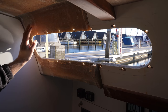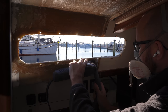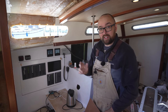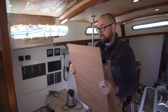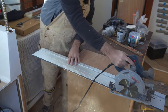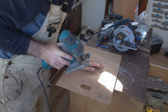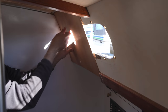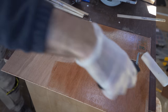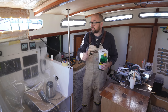There's a little bit of sanding or grinding required here to get rid of some unevenness, and I also need to cut away this piece of the old bulkhead. Turns out, the plywood that's used up here is four millimeters thick. I don't have a ton of that left, but I do have this small piece of scrap, which is perfect. I'll leave this a little bit oversized for now. I've added a couple of holes for some clamps for securing this thing, and I think we are good to go. So let's get some epoxy mixed up. For the sake of paranoia, I'm going to coat the back of this with a few coats of unthickened epoxy. While I'm waiting for that first coat to gel, I might as well take care of the cleanup on the outside.